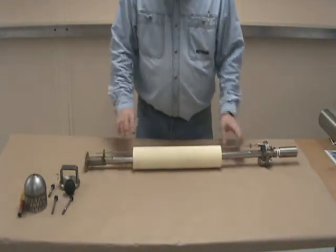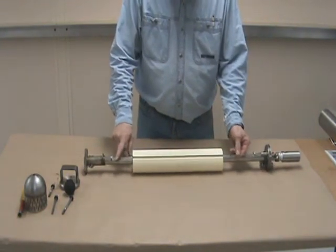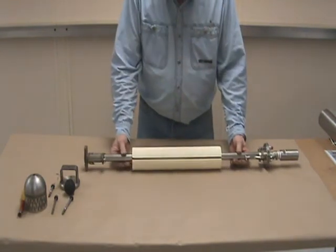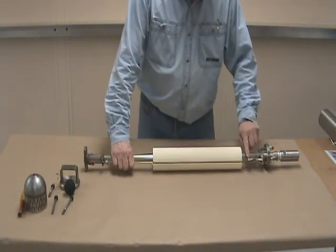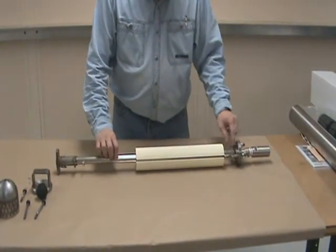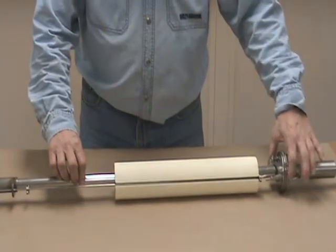Visually inspect the internals. This control rod here needs to be straight — not bent in any shape. One of the first checks you can do is bring your float all the way up to the upper control rod stop where my finger is, and push it with your float. You'll notice that the control arm linkage here will jump to the top of the head.